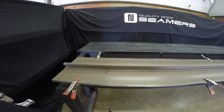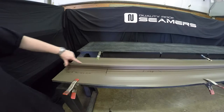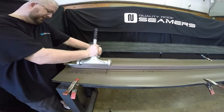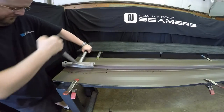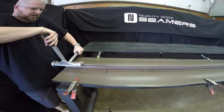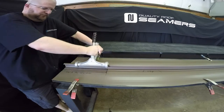For pre-crimping the Generation 2 panel craft panel, you'll need to pre-crimp 15 inches with the triple lock hand crimper. Start on the outside, coming in to about a 45-degree angle and then back out. Once you get out, apply full force pre-crimping all the way under and back out to the 15 inches.